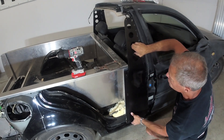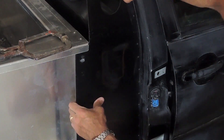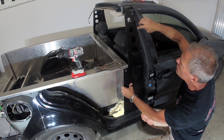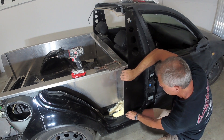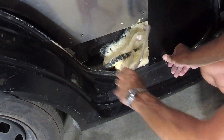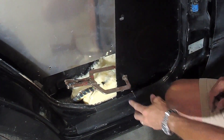So I come in from the bottom and wedge it between. You see this little flap here — we're going to be going flat up against it. In this particular case, I'm going to make sure the gap here looks good. I'm going to take a rivet here and just go through the 3/16 hole at the bottom, which I drilled, and I'm just going to grab this down here with a vice grip. It still moves a little bit, but I just have one rivet holding it together.